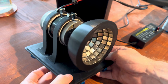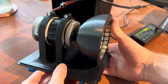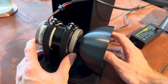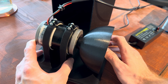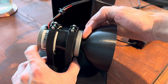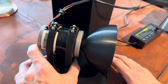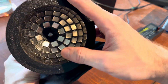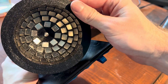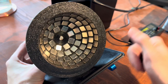After that, we look at the holder itself. It is also 3D printed and it's just one piece that holds the motor. The motor model number is ZY6812, which is a motor usually used for scooters or similar devices. On its axle it comes with a gear, and you have to remove that gear before you can attach the array. You'll probably need some power tools to remove the gear, but after that you're left with an 8-millimeter axle that has a cutout, which ensures the axle can spin freely with the array.